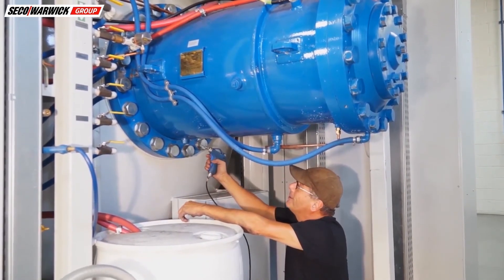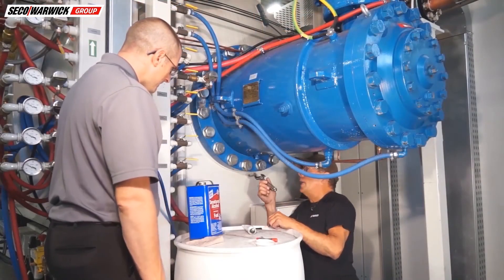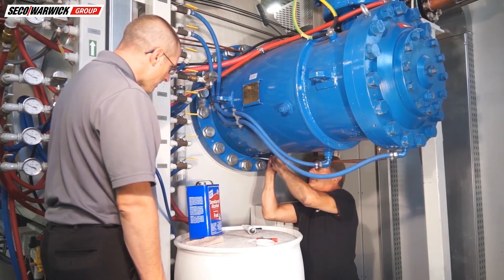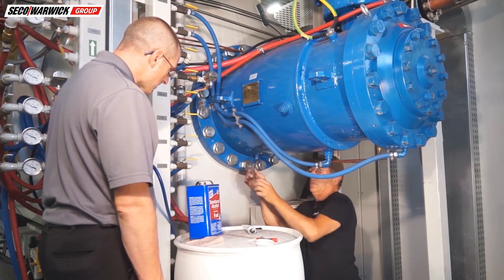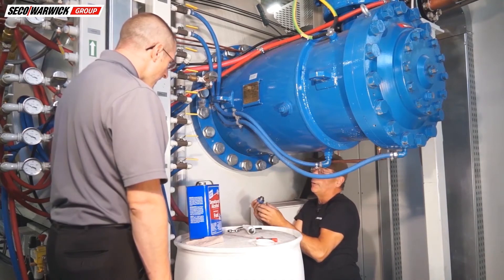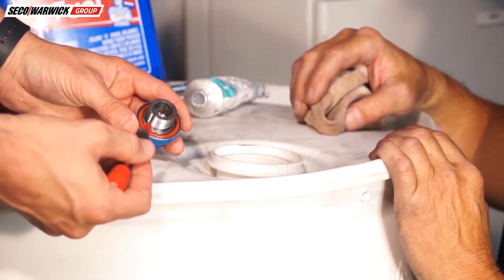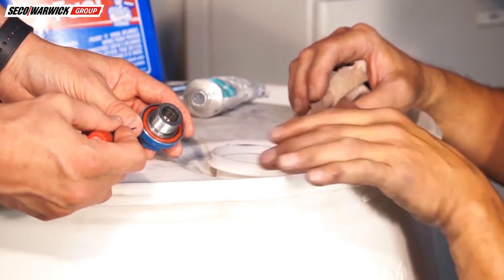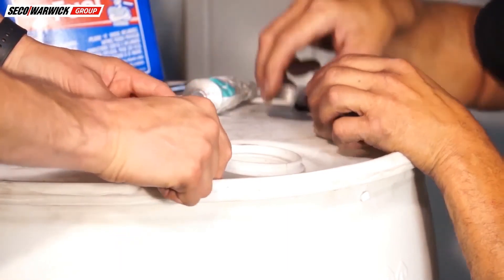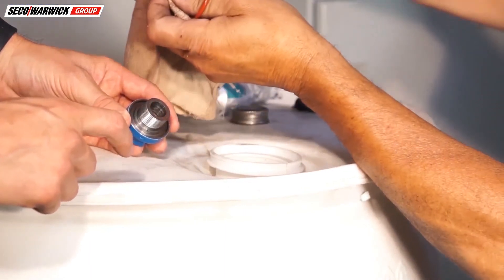We found it — that's a good-sized leak too! I brought the furnace to atmosphere and now I want to take the plug out so we can clean it because we're pretty sure this is where the leak is. I can feel it blowing out — the nitrogen isn't enough to cause concern. Look at that — we've got to take the O-ring off. There it is — that's a pretty big chunk of dirt. We'll get rid of that and gently pop it out. Looks like there's some other dirt on there too. I'll get a little alcohol and clean the O-ring itself.